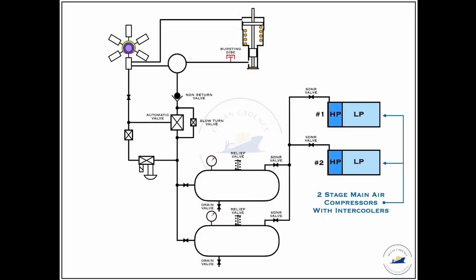The main air compressors are responsible for generating the 30 bar compressed air. The receivers are responsible for storing the 30 bar compressed air. The interlock mechanism decides whether the air is allowed to pass further in the system or not for the actual starting of the engine. The distributor system decides which particular unit the starting air is to be admitted into, to give the correct kick to the engine so that the engine starts in the correct direction.